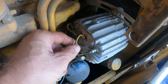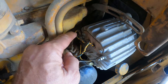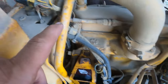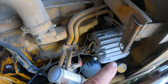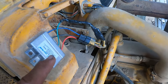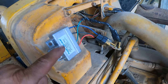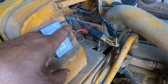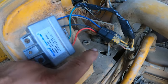This is a ground wire. This is a feed wire, and this is also an ignition wire, and this all goes through the wire harness and up to the new voltage regulator. This does not have an internal voltage regulator — it is an external voltage regulator and there is no relay. That's important, because the updated information that they send you with this new updated one — there's only four wires coming out of here and the wire harness has five wires. So let me show you guys really quick.